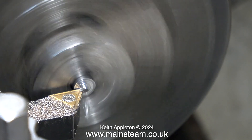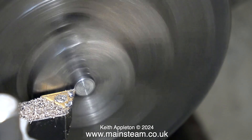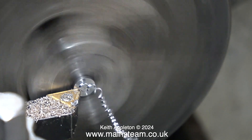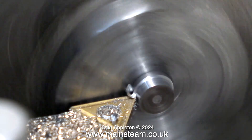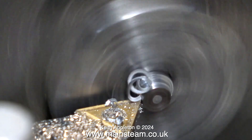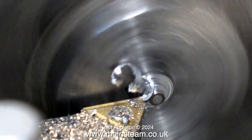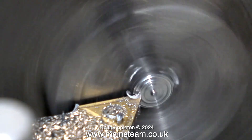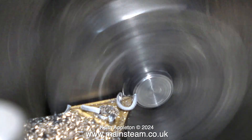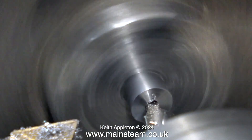Why didn't the part come loose right at the beginning? It's all a matter of speeds and feeds relative to the diameter of the piece and where the lathe tool is at any given time. I've refitted the part into the chuck holding it by the main body so it's not going to jump out this time. The chuck is revolving at a constant speed, so the metal is going past the tool at the outer diameter much faster than when the tool gets nearer the center. If I'd been more gentle and taken finer cuts near the center I wouldn't have had the problem. It's never a good policy to hold a part by a very small protrusion.